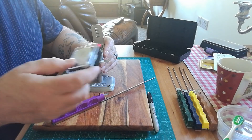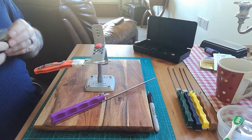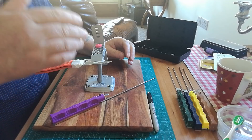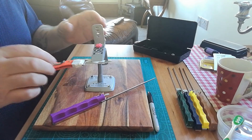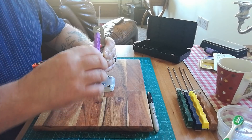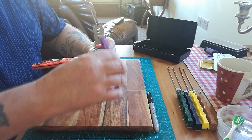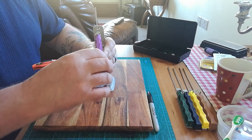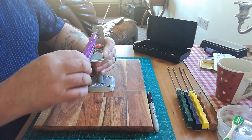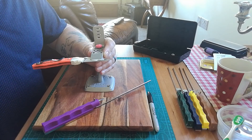The other thing I use is a little magnifying glass to check that you've got the bevel edge, because sometimes you look and you think you're down at the edge but you're not. Get the little magnifying glass and have a real check just to make sure you're cutting right down to the edge — that's where all the sharpness comes from. 440C, like most cheaper blades, is easy to sharpen, that's what's good about it. I'm going to pause and do this until I get the burr, then I'll show you what I do after that.